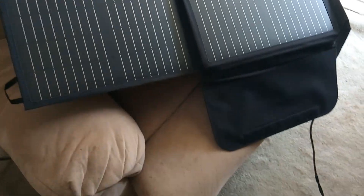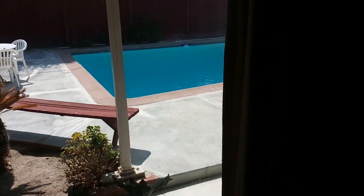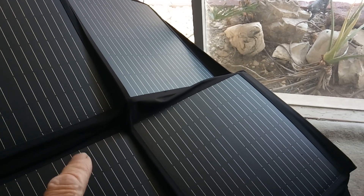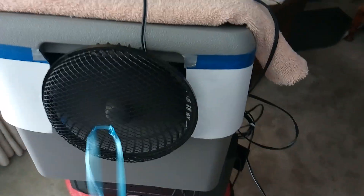What I've got is the input coming in here — what little I can get through the window. This is a 200-watt panel just placed at the window. If I had it up against the window I'd probably get more, but with a 40-watt consumption versus a 200-watt panel, that panel should win the battle if it was in full sun, to make this run all day long and cool us down.